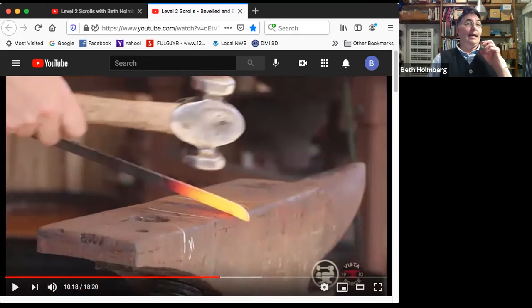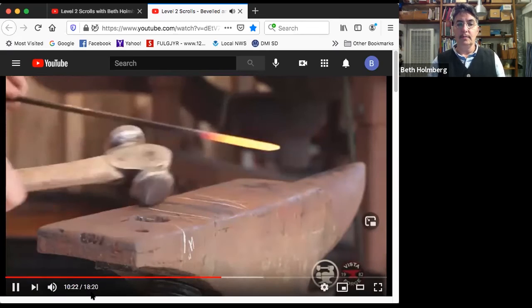Okay, I'm gonna now put in those half face blows to separate out the leaf. Where does that start? About the same place where the taper ends. So again, it's only gonna be about 3/4 of an inch at most hanging off here. We need a really, really short leaf or it does weird things. It will grow as we work our way along.